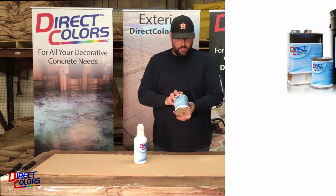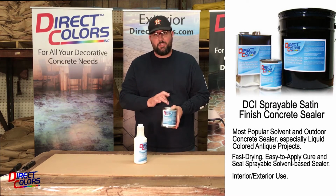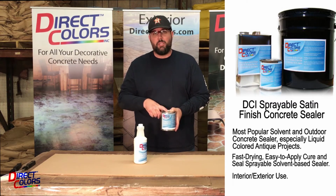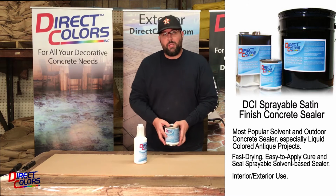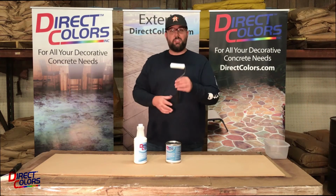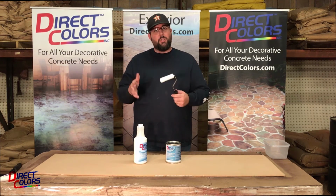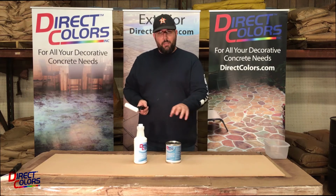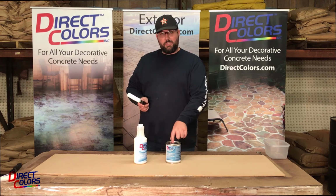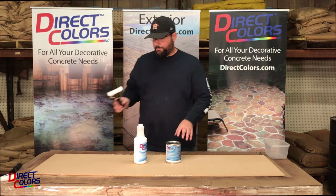This one is our DCI sprayable satin sealer. This is a satin finish solvent-based sealer. You can spray this on through a pump sprayer, really either one of them. You could put on with a pump-up deck sprayer, or you could use a 3/8 inch nap roller. For the size project that I'm working on right here, just using a mini roller, it's a 3/8 inch nap on a 4-inch roller. For your floor, you'd use a regular paint roller. If you're using a solvent base, you need to get a solvent-resistant core. Otherwise, the solvents in your sealer will eat up the core and start releasing fuzz into your finish.